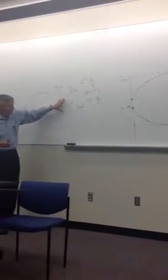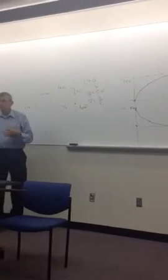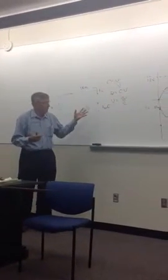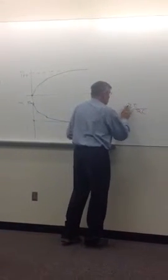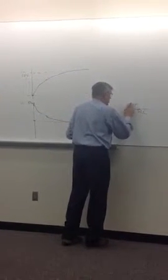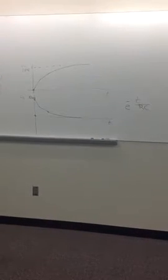Okay, a bucket or a capacitor here, putting electrons in. If you've got a bigger bucket, it's going to take a lot longer to get the voltage to rise on that or change the current. So without going through or deriving the differential equations on this, e to the minus t over RC looks like a good bet on this one.